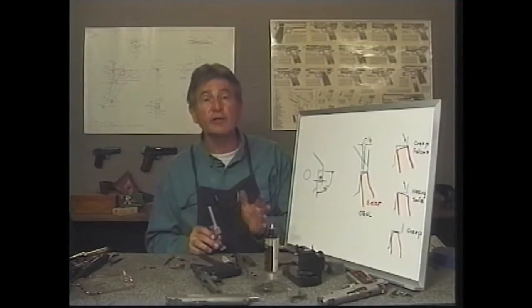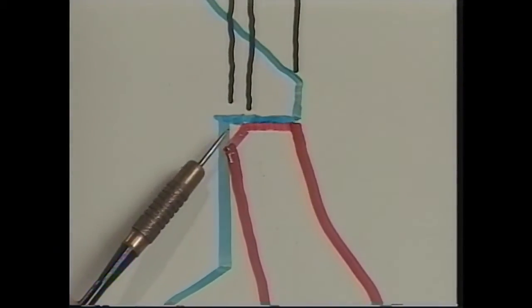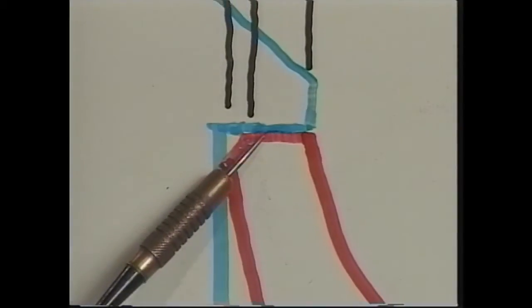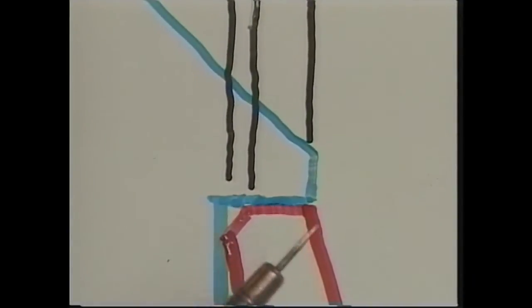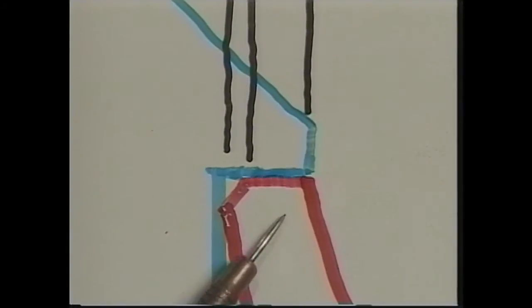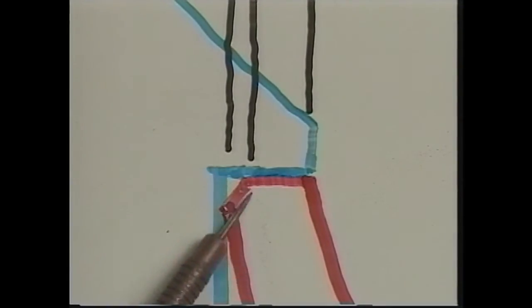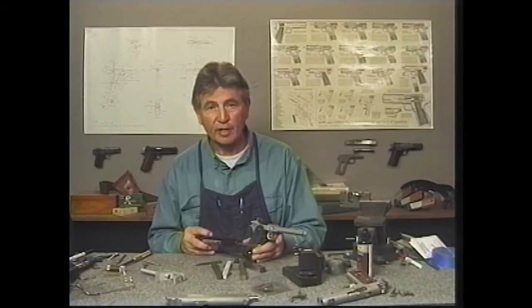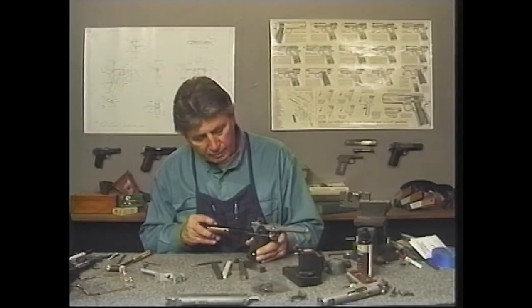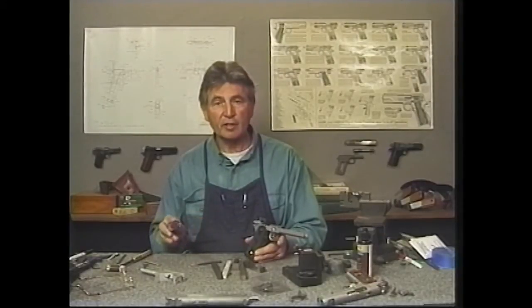How much back angle do we need? There is a general rule of thumb — let me show you here. This is our ideal relationship between the sear and the hammer. Normally, this point from here to here is usually one-third of this area here that rubs. Now, it can make a difference if you have a very narrow sear here. I don't like those type of sears — I will usually discard them and get one where the sear actually comes out at least to here. So usually the rule of thumb is one-third of this distance. Let's see how much we've picked up on reduction of our trigger pull. It's three and a half pounds — we have picked up a half a pound just by cutting down the back angle and polishing the nose of our sear face.